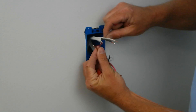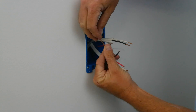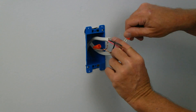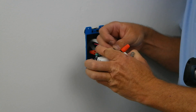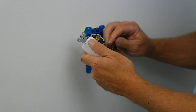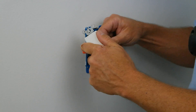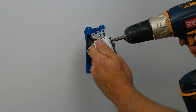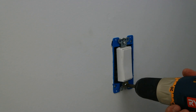To install the wall switch, first connect the ground to the switch. Our actor is not an electrician and missed this step — even though the fan does not need to be grounded, the switch should be grounded. Then secure the black wire from the power circuit to the switch, and finally secure the black wire from the fan to the switch for high speed, and the red wire to the switch for low speed.